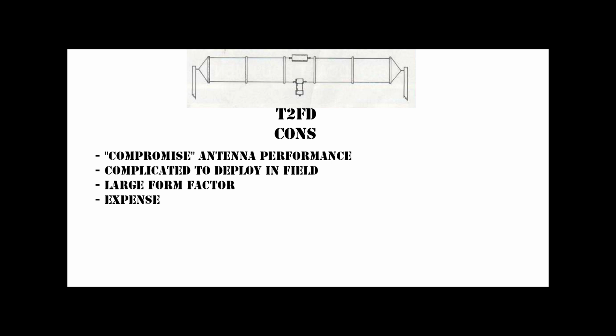The antenna is not particularly easy to deploy in the field. The elements should be deployed and stowed carefully, paying attention to winding it on a tube greater in diameter than the end supports, adding to the parts count. I made mention of the weight of the core components mid-video. And in order to support the antenna from the ends only, you need really stout objects as anchor points, and fiberglass poles are a total no-go.